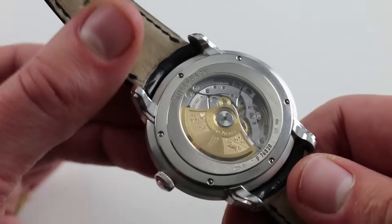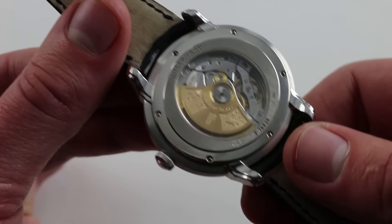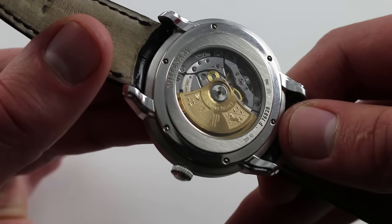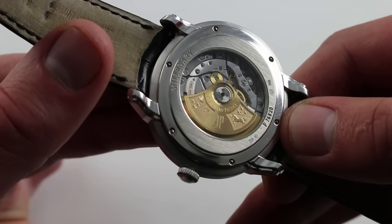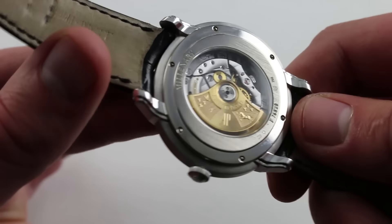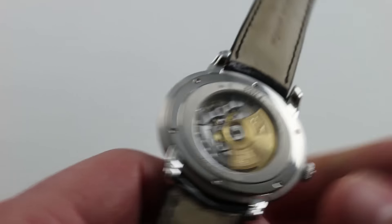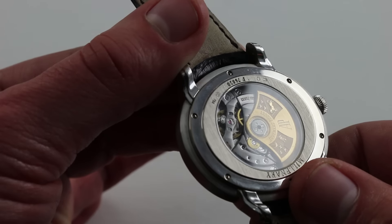The case back is just as appealing and even more fearsomely complex. What you're looking at is the Audemars Piguet in-house caliber 3120 — 40 jewels, bi-directional winding. You can see the coats of arms of the families Audemars and Piguet on the gold winding mass. Of course, the company is still owned and operated by the founding families. You also note the Côtes de Genève — the Geneva waves across the bridges.